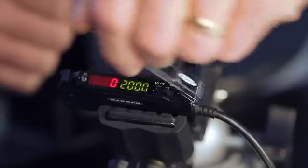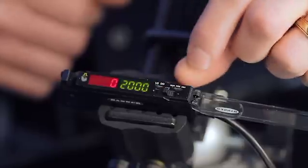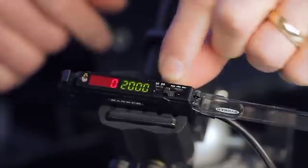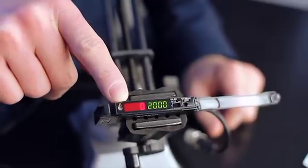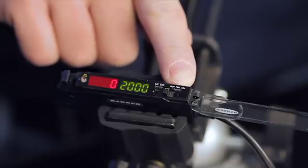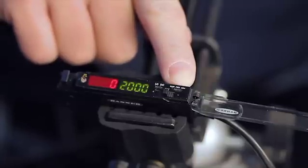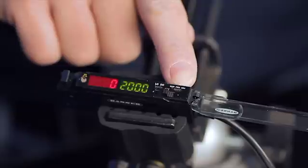Opening the dust cover, we find a light operate, dark operate selector switch to control the output logic. An amber output indicator shows when the output is conducting. A three-position mode selector switch controls the operating mode of the amplifier. The switch is labeled Run, Program, and Adjust.